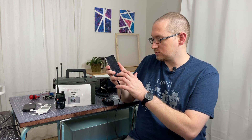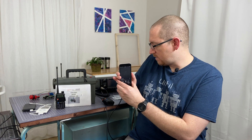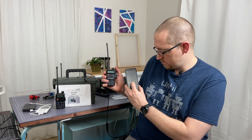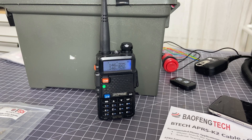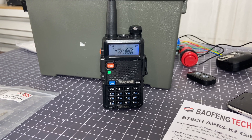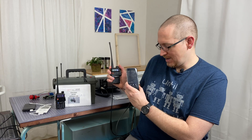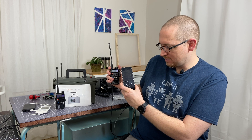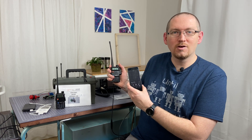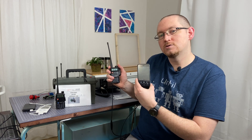Let's just show you how this actually works. I'm going to skip off of the silence here and back to Fox Hunt 1. I have the radio and I'm just hitting play. 'This is the AC3DS Fox Hunt, transmitting on 146.225 megahertz. Catch me if you can.' And there you have it. It's now playing the Fox Hunt silence file — the track that just has nothing in it. Even though the phone is playing it, the radio is not, because in order for the radio to actually transmit, it has to detect an input over a certain threshold.